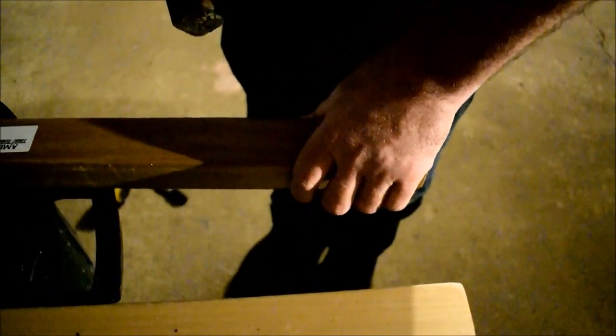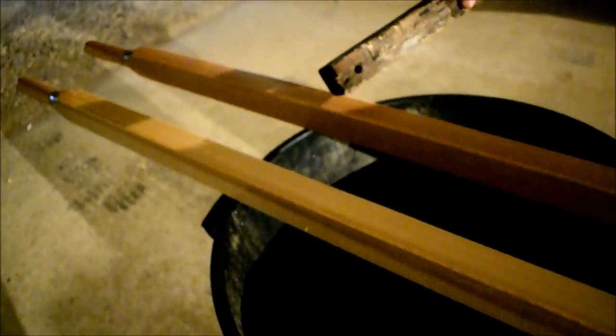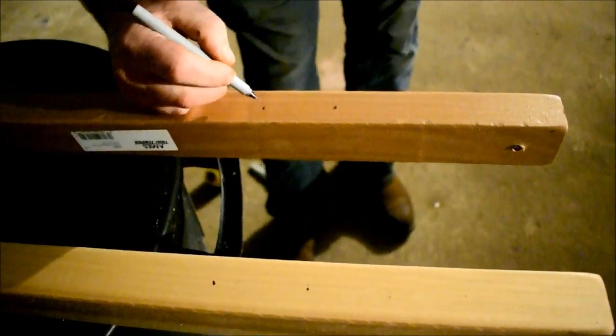Yes. On this side, this is 1¾ inches, and when you turn it this way, it's 2 inches. And these are the new standard handles that they sell you. You're either going to put them on sideways or lengthways, and that's for strength. But when you're drilling a hole down the center of them, particularly the back handle hole, is where it snaps when you pull up on it. So do you have enough to drill through and still have side meat to hold for strength? I guess you would want to drill as small of a hole as possible. Yes. For 5/16, we're drilling slightly bigger than 5/16 to accommodate the bolt going through, and plenty of stuff to get in a hole.